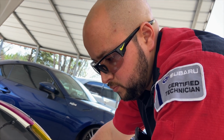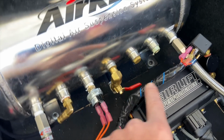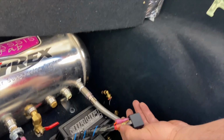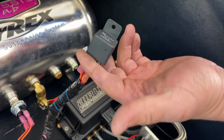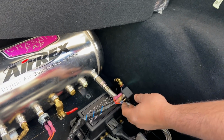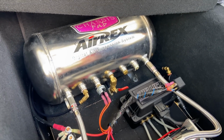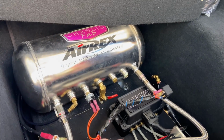Oh, absolutely. I think it's somewhere in this or possibly in this switch that's not signaling off, but it won't turn off on its own. It could be, just by judging on the wire, that the relay is actually stuck in the on position, or burnt inside. But we can take a signal off of the pressure sensor and see what's happening. See if it's putting it out right. Absolutely, yes. It's a 200 pounder, so that'll give us that, and I'll show you how to operate all that from the inside.